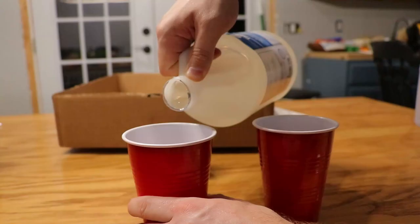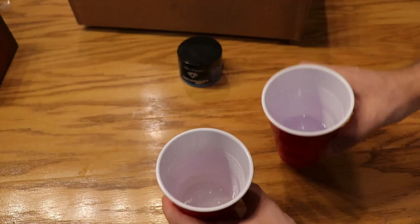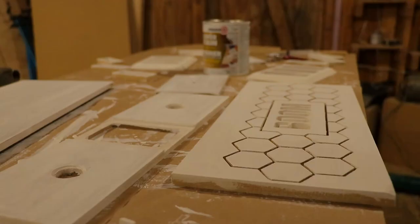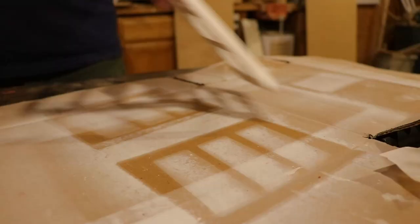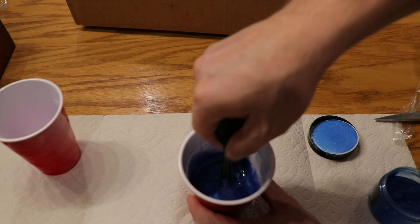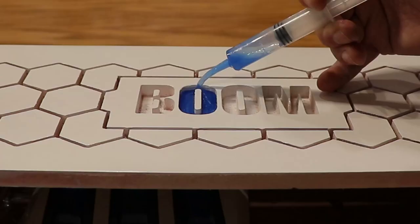With all of these things done, I decided to take it one step further. There's a craze in the DIY world, and that's epoxy pouring. Crazy enough, there's not a lot of epoxy pouring done on speakers, so why not do it on this project? Before I do that, I kind of paint the whole thing. I went ahead and used some oil-based primer, sanded it all the way up to 600 grit, and then spray painted it the colors I wanted. I went with this bright blue because I thought it would really contrast well with the white, and also get that cool look with the black as well.